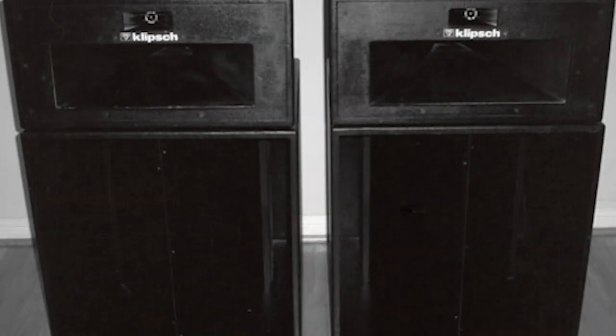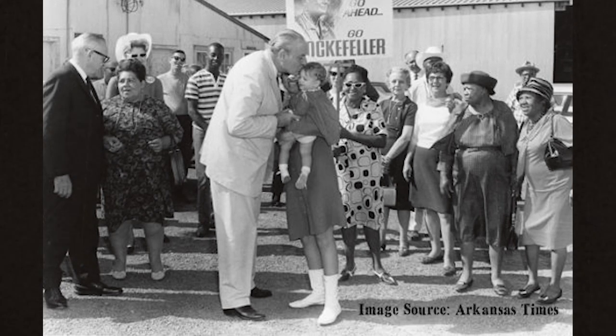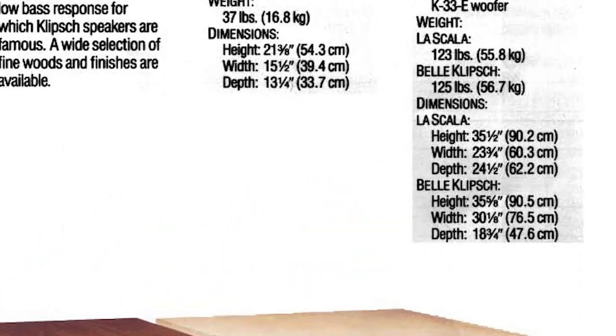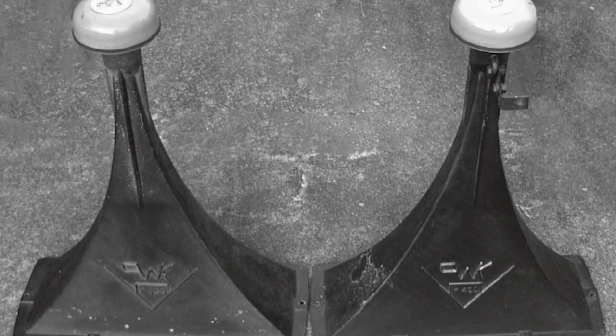You'll notice the woofer sitting on top — that's the tone standard from the early 80s, 1980, for the professional Klipsch La Scala. In 1963, the La Scala was engineered to be a professional public address speaker. They were actually using this speaker as a portable speaker for Winthrop Rockefeller's gubernatorial race in Arkansas. It was built in a carry-around package at around 123 pounds. It had the K33J with a Jensen driver for the woofer, a K400 aluminum cast horn for the midrange with a K55V Atlas driver, and a K77 Electro-Voice tweeter.